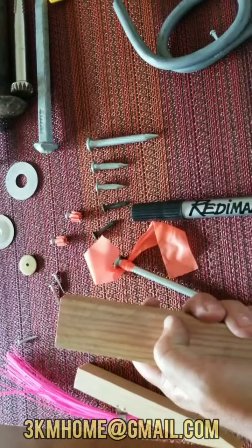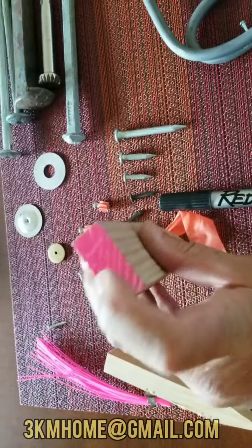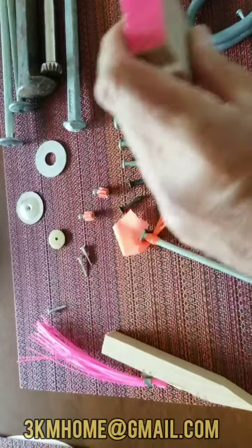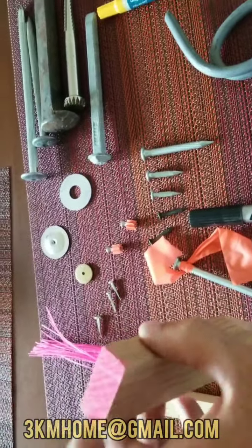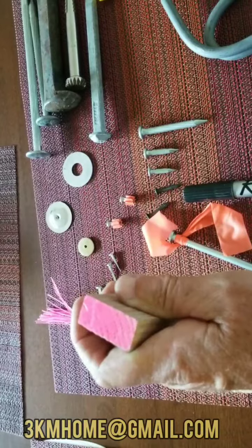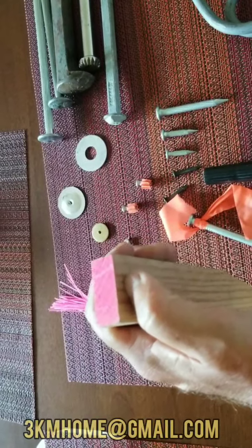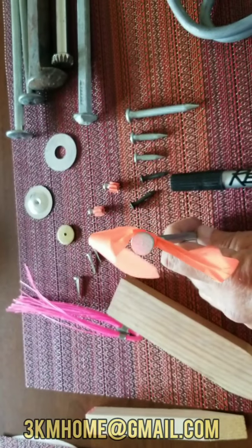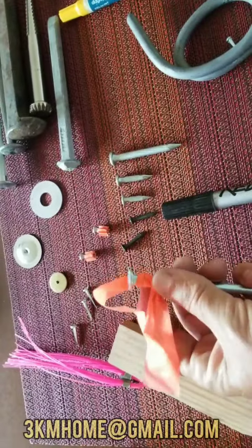Sometimes I'll still throw a couple of hubs in my pouch, just in case it's soft dirt, or I'll use hubs as control points since they look different from the nails. If a job site is full of nails but you see a hub with a feather, a tack, and lath basketed around it, I like to use those as our control points. It also lets you know if it's been disturbed — if something hits this hub, it's probably going to be chipped or cracked. Nails are sometimes harder to notice if they've been hit. We tie the flagging on in the field.